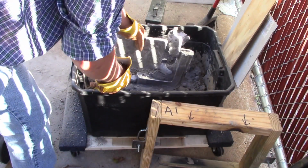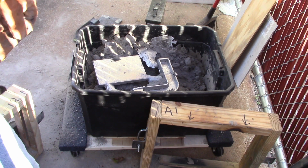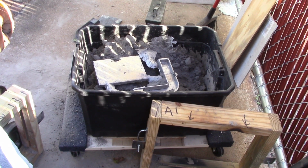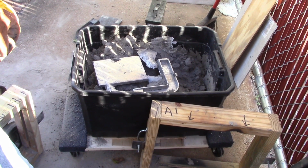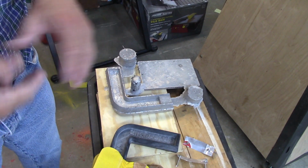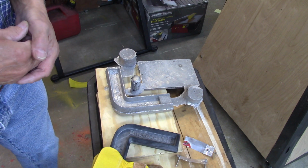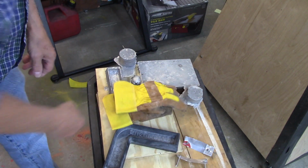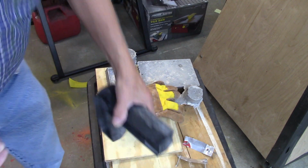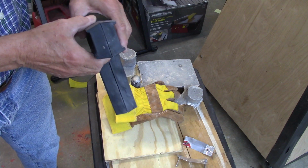So we're doing all right. I'll take this thing, clean the sand off and everything, cool her down some. We'll go and cut it off with a hacksaw or bandsaw or something and see how it looks up close and clean. Now we had some learnings from this, because I'm not an expert on making patterns or casting, and Bruno's not either, so we waded off into this thing and we discovered something by accident, that you can have actually too much draft. And this is too much draft.